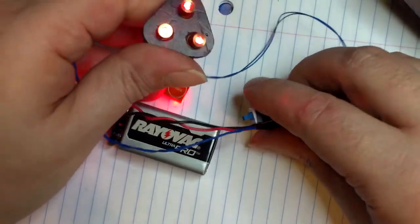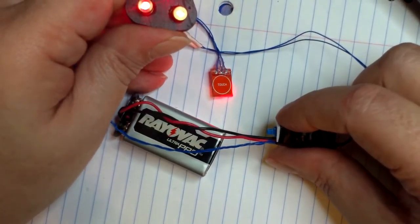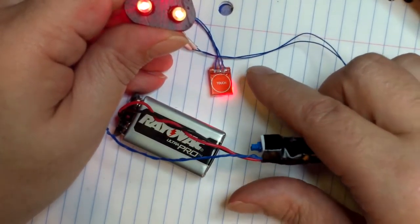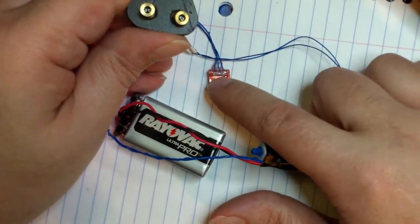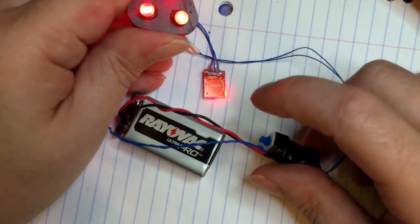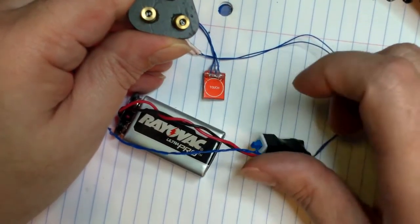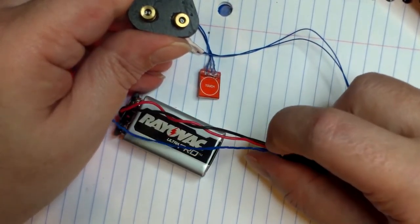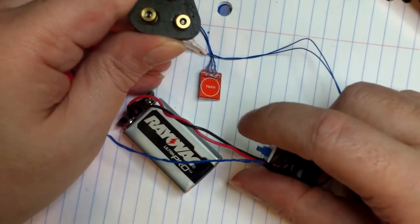my thing touched, over here we have the master switch. The reason why is because our 9-volt battery has to run a regulator that's in here, and also we have to run the electronic switch. Okay, so like this, in this mode it can turn on and off using the touch switch, but when you're done using it for the day, it's still using power even when it's off. When you're done using it for the day, then you turn this switch off, which disconnects from the battery and saves your battery. Okay, so that's all this is really for.